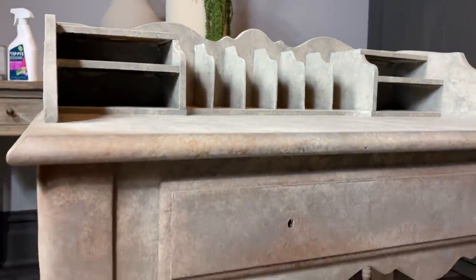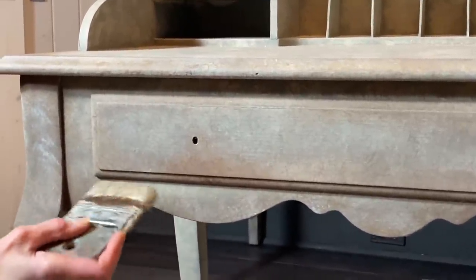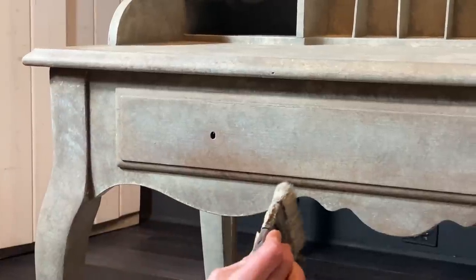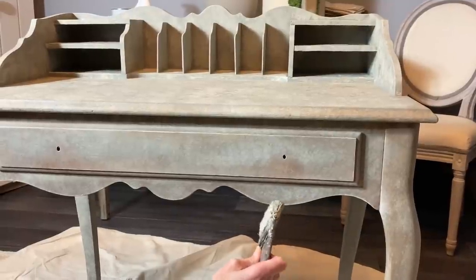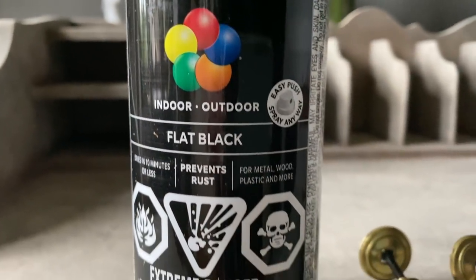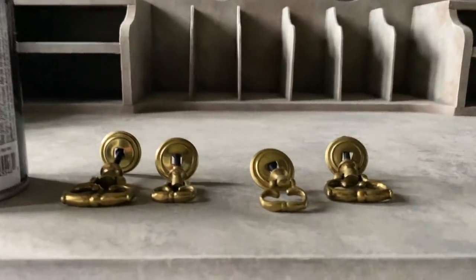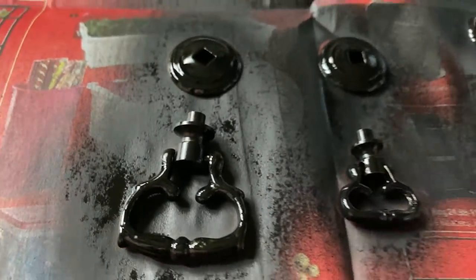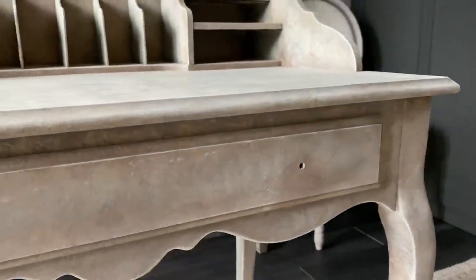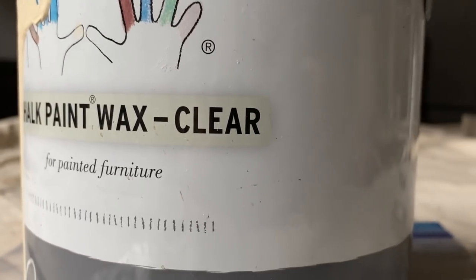I always find the most organic way to make something look aged is by building up layers — you can put as many glaze layers as you want and create as much texture as you want. To make it look more natural, I just dab on a little bit of the original base color as another layer, and once it dries it just looks like it naturally aged over time. For the hardware, I'm using Krylon flat matte paint and primer spray paint to update it without smearing on the metal surface. Once all the paint and glaze is completely dry, I'm going to seal it with a clear wax — it's just like adding moisture to the chalk paint, enriching the color and texture. Apply it like a moisturizer, rub off any excess with a clean cloth, and it should be fully cured in about 20 days.